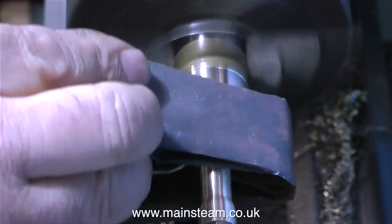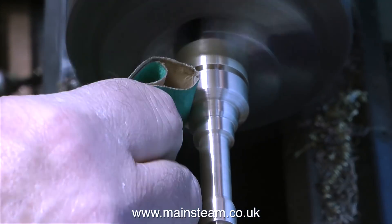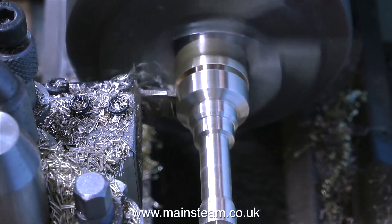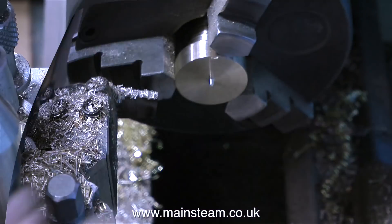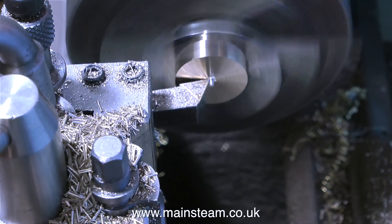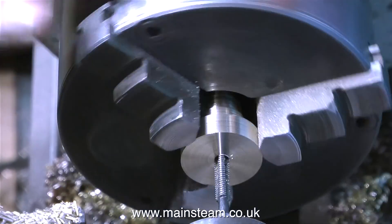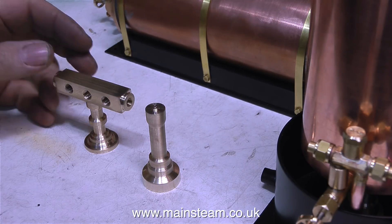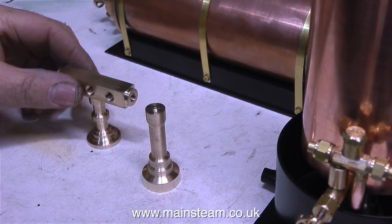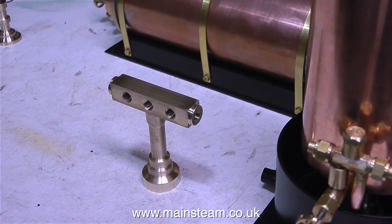Now it's time to clean up the part using some emery cloth. I'm using coarse sandpaper, followed by medium sandpaper, followed by wet or dry paper. The thing about making items like this is that you decide how you want it — you're not following a drawing, it's totally out of your head. When doing basic ornamental turning like this, don't make the part too fussy unless the rest of the steam plant is equally fussy. I prefer the column on the right-hand side — the left-hand one is too short and too fussy. When I place the manifold on top of the taller, simpler column, it seems to look more in keeping with the rest of the steam plant.